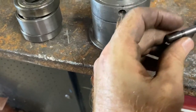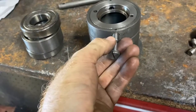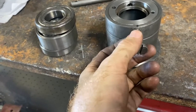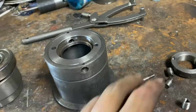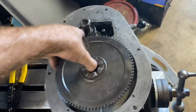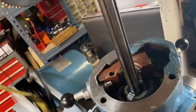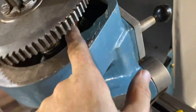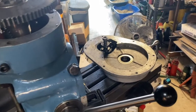I had to remake these and I actually don't recall what the originals look like. I think I was having an issue with getting it back mounted in the hole, so I actually put an outer sleeve and then threaded an inner part like that with a notch, with that being the outer nut. It's got a big head because it has to do that ring that I showed earlier. So once the power gets to here, it's going to go all the way through. This is the bottom side — that has a spline in there and it goes over here into the bottom part. It also connects with some of the gears that have to do with the down feed. So that's how the torque gets into the spindle and down into the tool.